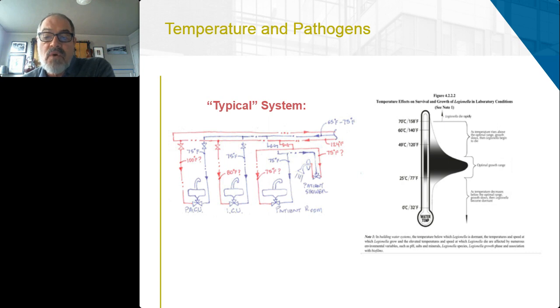We have cold water that is basically cooled to the ambient temperature of the building. And since the faucets are low flow and they flow half cold and half hot, those cold water systems experience water age issues too. But there are very, very few documented cases of Legionella or waterborne pathogen issues coming from the cold water systems.